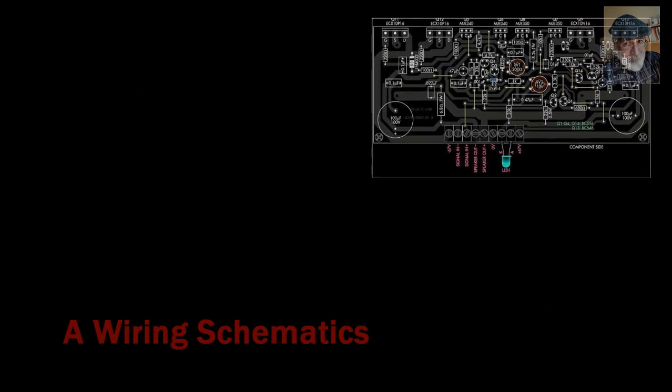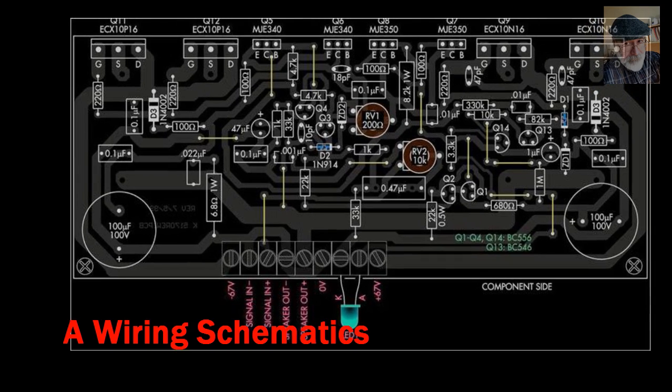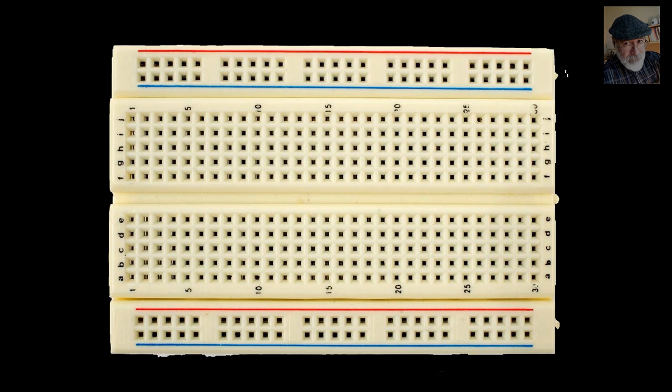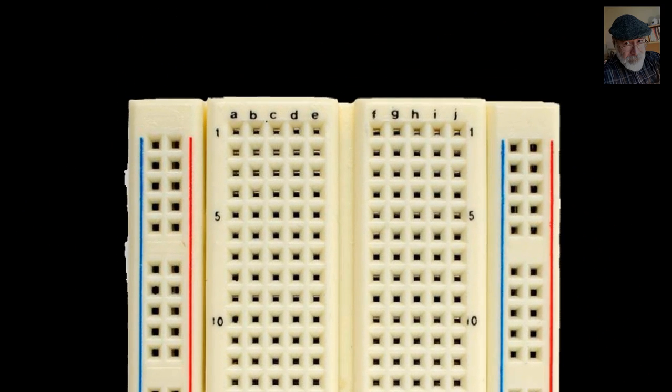On the other hand, the wiring schematics may not be easy to use to analyze the circuit, but it specifies in clear detail how the circuit is assembled, in our case, down to the detail of which multi-clip and which hole will be the joining point of each component's terminal. Remember, we identify a hole in the protoboard with the number of the multi-clip and a letter.